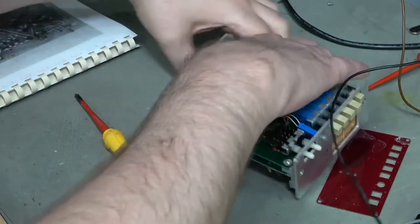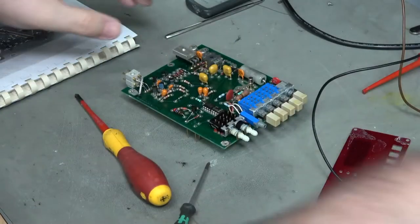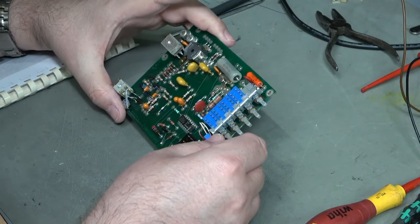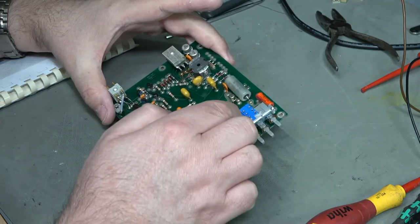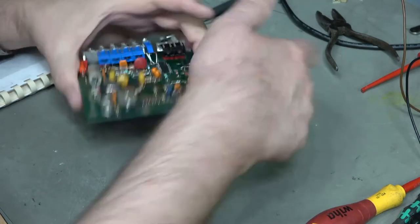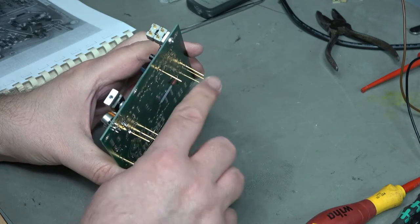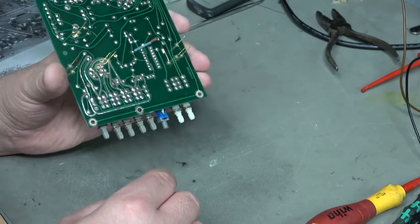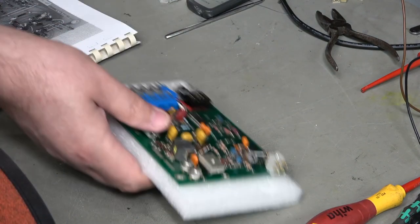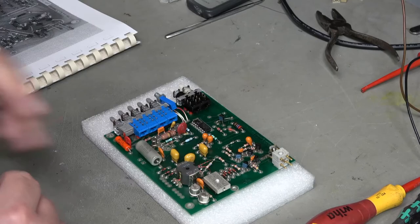At the moment the input voltage is being pulled down so low it's very hard to work out what might be doing that. We still don't really have separation between the power supply and the circuits it feeds, but we're certainly better - we've only got a few components up on the top here. I need to be a bit cautious because there's a whole set of pins here that penetrate through, so I'll put something in to stop those pins getting damaged while I work on it.